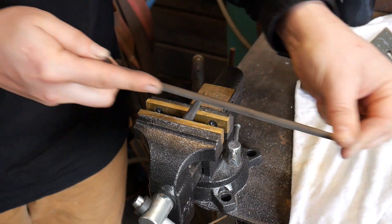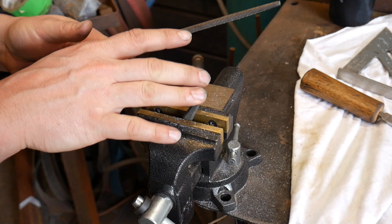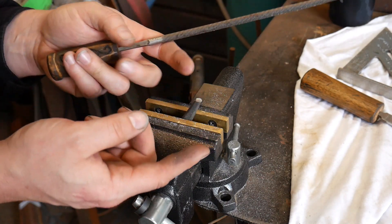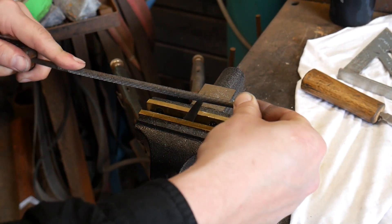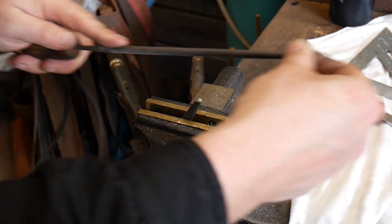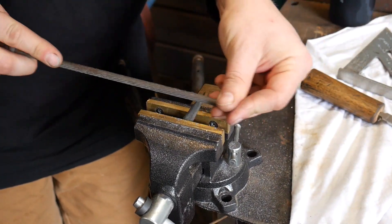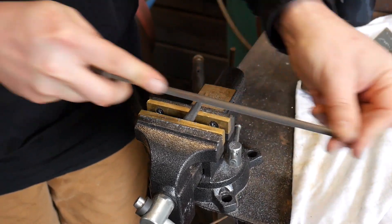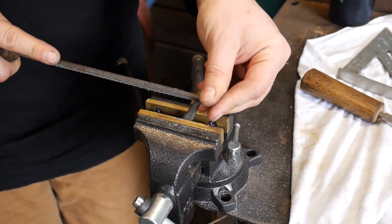If this was a larger concave butcher tool, you can use a larger diameter round file, or you can even upgrade to a small width half round file, which is a fairly nice file to use. We want this to constantly stay at this flat 60 degree bevel. You're not going to escape that. Just keep taking it down until you've got the full width taken care of at 60 degrees.